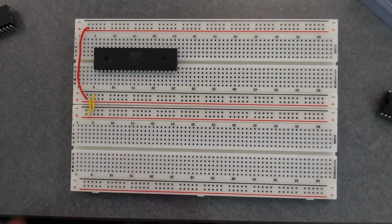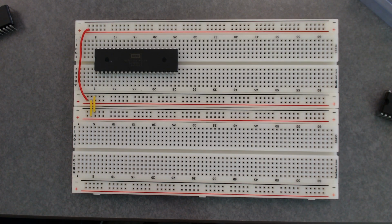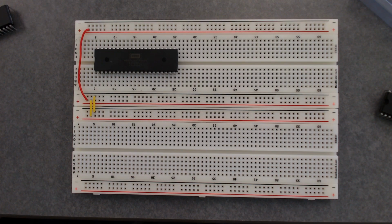It should be on the left. Okay. Yeah. All right, so what all do I need? I need a poking instrument. Yeah. Okay, so I need four. Right, black wire to this far corner pin. That's the ground pin. Pin 8, which is 1, 2, 3, 4, 5, 6, 7, 8, is this one, and needs to be on plus 5 volts. Okay, so there's plus 5 volts. So get that one, and then also get the ground, which is the only black wire that's on here.